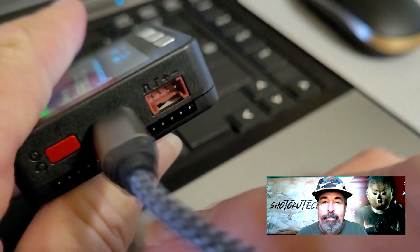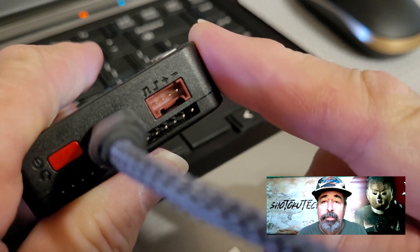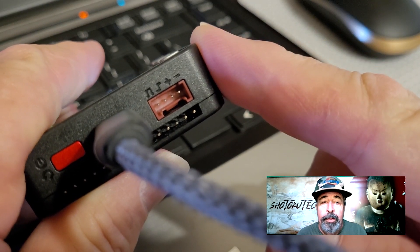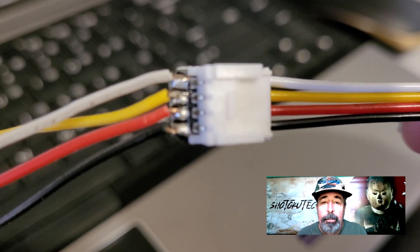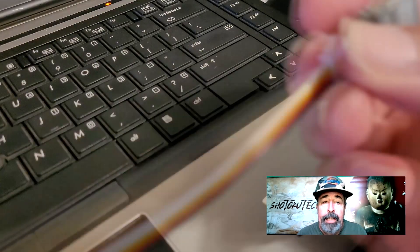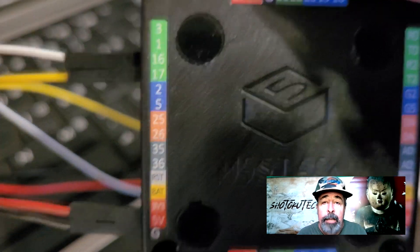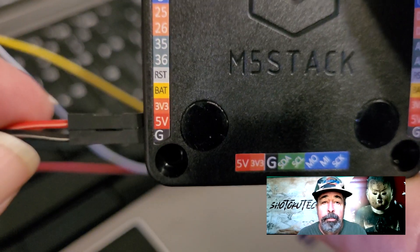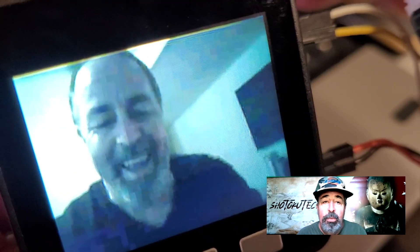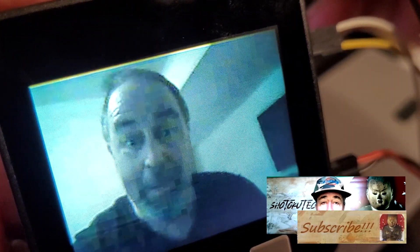But the stock M5Stack Core only has this one port A grove connection available. To access port C, I needed to make this cable by soldering some male DuPont jumpers onto this grove pin adapter. These jumpers in turn were plugged into the holes in the M5Stack Core base. This left me wondering if there is a way to add port B and port C to my M5Stack Core units.